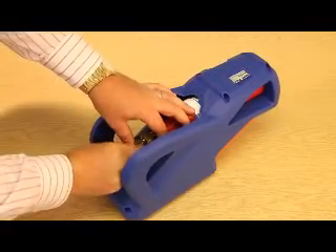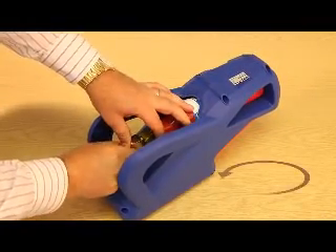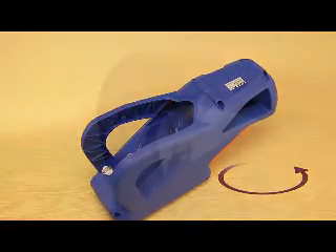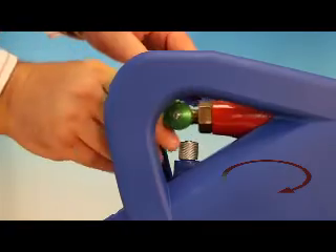When the hydrogen gas pressure is low, a new cylinder is easily inserted. The screw connector to Gastek's pressure regulator is turned anti-clockwise to disconnect the cylinder and clockwise to reconnect.